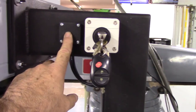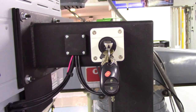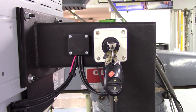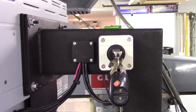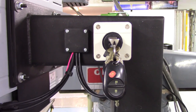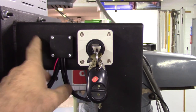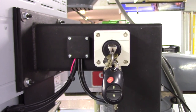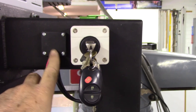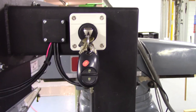So this is a 3D printed cap. It's actually designed after Centroid's servo motor cable strain reliefs that you can buy from them. And it's turned out to work out really well. So I've got a large hole drilled into this original steel operator console mount. And it's deburred, so it doesn't cut anything, but it allows getting cables back into the cabinet down here.